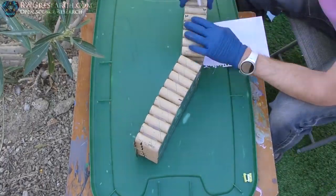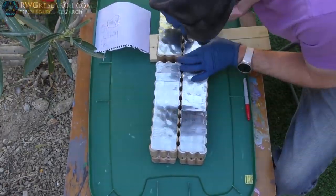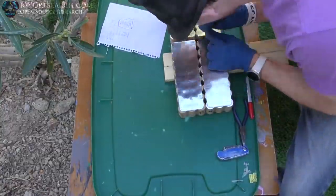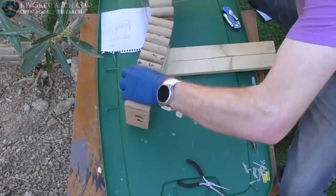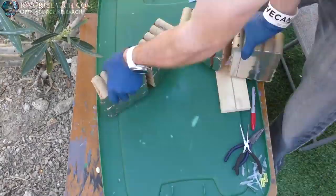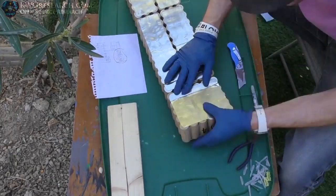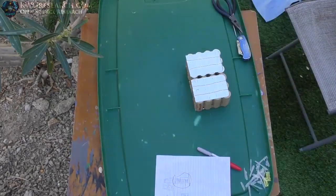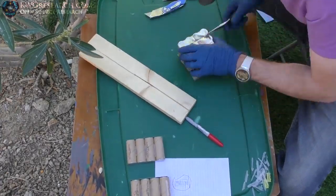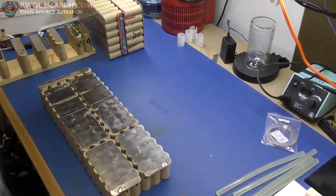Here I'm marking the battery connections and parts and pieces that I'm going to cut. And this is nickel strips, so if you use a razor blade and you score it, then you can slightly pry at the score mark, and you can end up breaking it quite nicely. It's actually the best method I've used, because otherwise if you cut into the battery, you'll short the battery, and it causes some major problems, as you can imagine. So I'm just cutting all these up, making them into individual pieces so I can fold the battery up into the shape and have all the connections made as I wish later on. So yeah, pretty straightforward stuff, but you got to do it. It's kind of dangerous, but it worked out well.